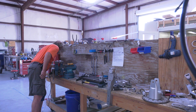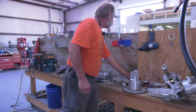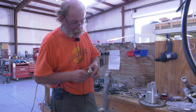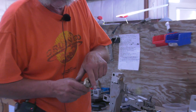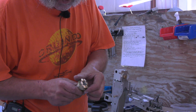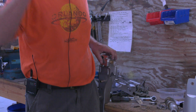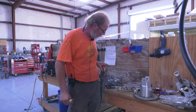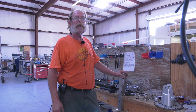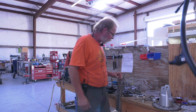It's just a castle nut like this, running the cotter pin in here — or moving it one slot. This is what I usually do: finger tight, and then I give it one more notch. This just tightens it enough to temper the vibration of the rotor head. Most of them, after a few hours, they usually reset the nut one flat more.